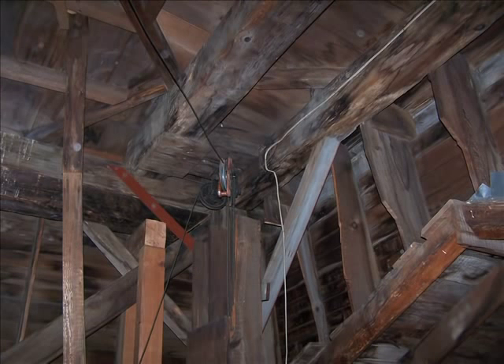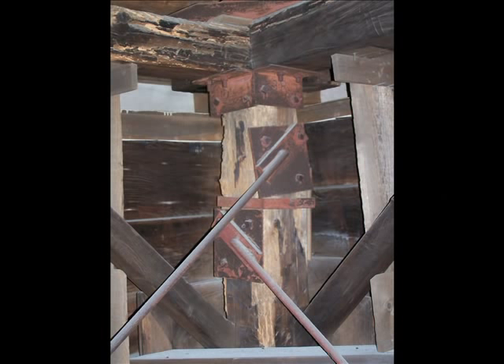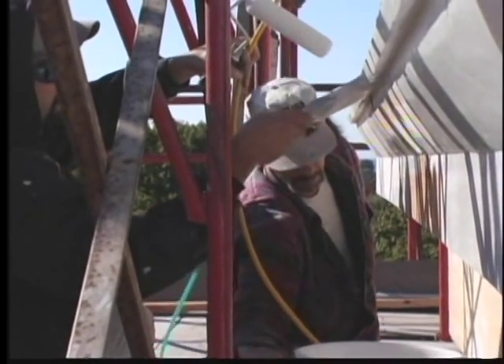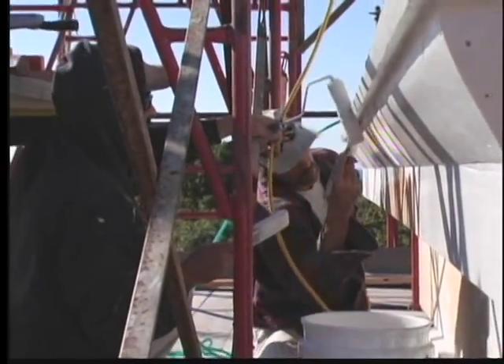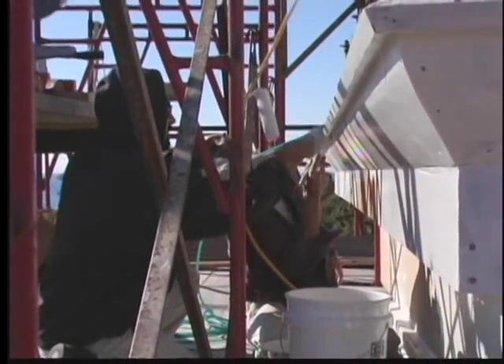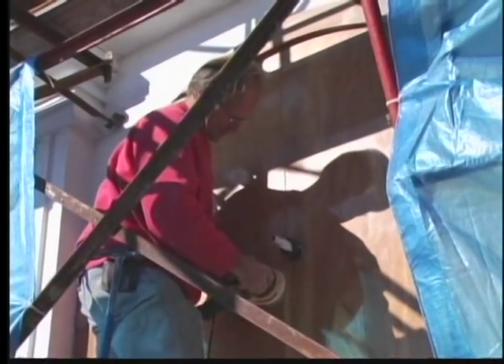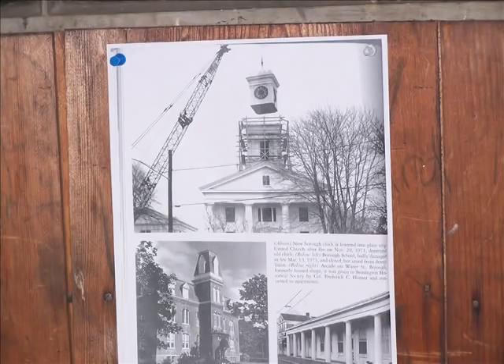This is the base right against the roof. You can see at one point those vertical boards underneath the plywood were just painted — that was it. Then along the way somebody clapboarded it, so we refastened everything, skinned it up with plywood, and re-clapboarded it. That also revealed that in some cases there was very little or no flashing between the tower and the roof, so we were able to reflash the whole thing with copper and make it as watertight as possible.